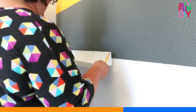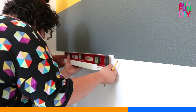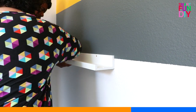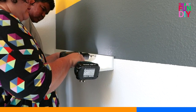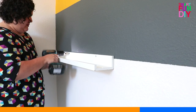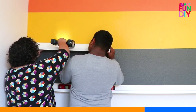Once the paint is fully dry, start adding your shelves. Put the shelves up against the wall and use a level to make sure they're level, then mark the holes. If you're mounting into drywall, use drywall anchors — mark the holes first without drilling in right away. Put those anchors in, then attach the shelves to the wall with screws. If you're using frame shelves, they may have little stickers to cover up the visible screw holes, so make sure you put those on.